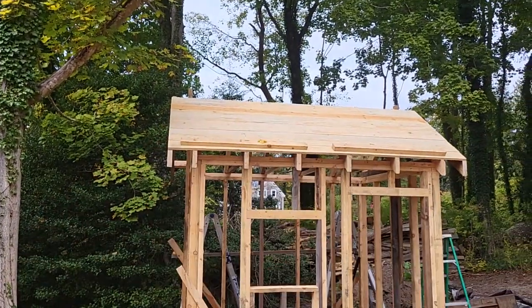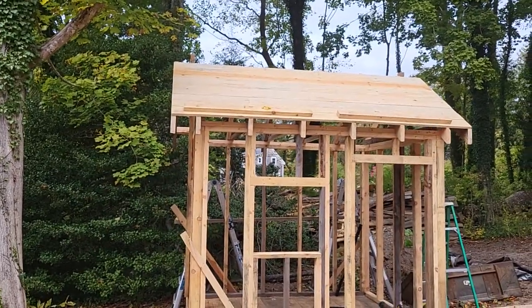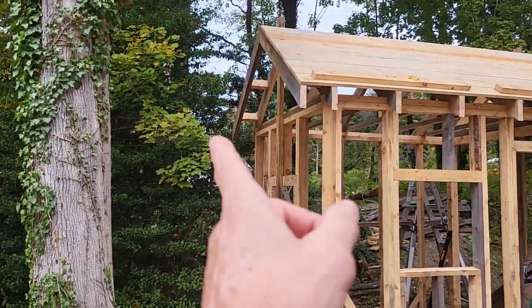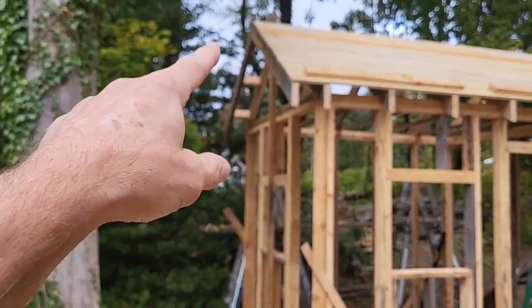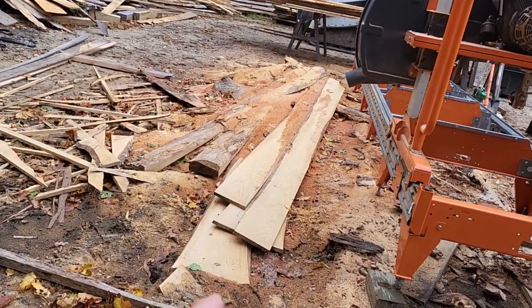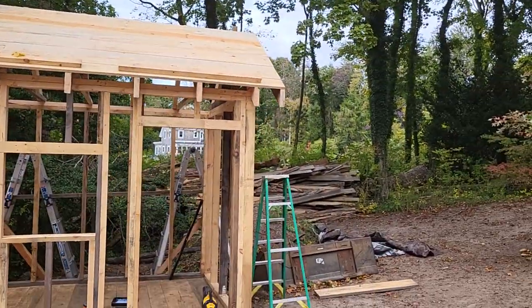I'm unsure what I'm going to do for the ridge cap yet, but you can see super strong pitch pine on the front. You can see the fly rafter set up there — that was just to make it so that my dimension works out with fascia. That's getting white oak fascia board on the ridge and a white oak fascia board across here. The only reason I'm using white oak — I'm not a snob — is I've got a pile of it sitting around the mill. So when I edge down, I will make fascia for the front and back and for the ridge boards and get them on there before I paper it up.